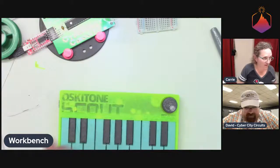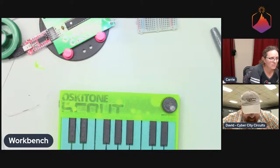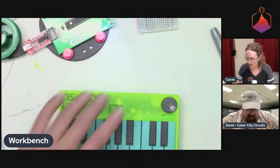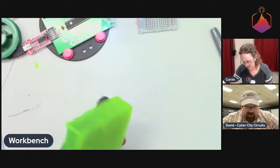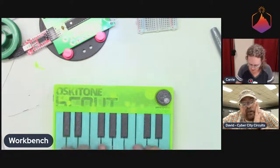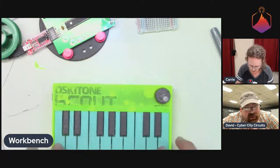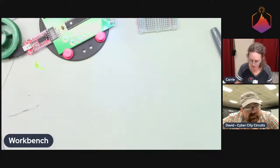Sticky key. All right. Okay. Let's see. Machine screws. Everything was fine. The screws may seem unnecessary, but using them will cut down the mechanical click noises from playing. Don't skip them. We didn't skip them. Not too tight. If we over-tighten, keys will get held down. Just back up a little bit. I usually don't over-tighten screws in plastic, but just to make sure. How easy do you think that thing is to take back apart? Not bad. Just undo the two screws and pop it out.